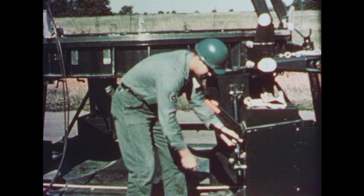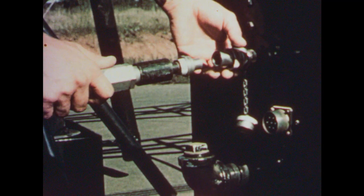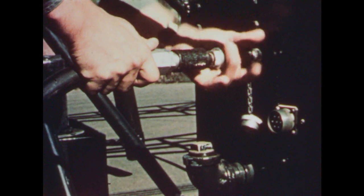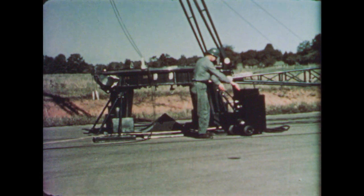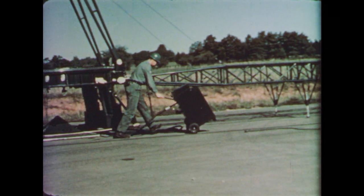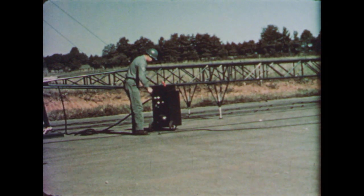The other end of the hydraulic hose is attached to the pressure outlet on the front of the hydraulic unit, which is protected by a dust cover. Reasonable care is taken to avoid cross-threading. When properly tightened, a leak-proof connection exists between hydraulic unit and snubber cylinder. Rolling the cart from the launcher helps clear the ring area for missile erecting activities. The cart will be left here.